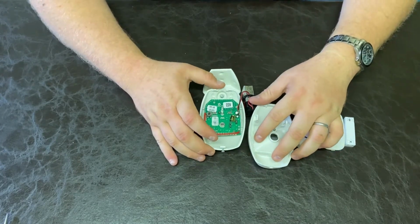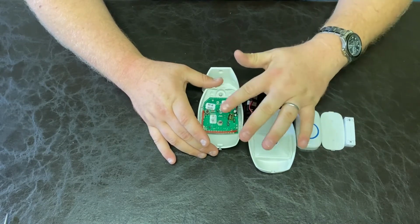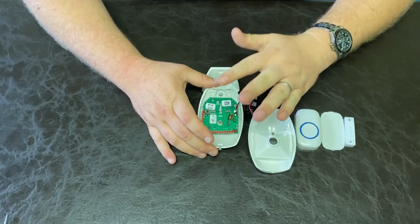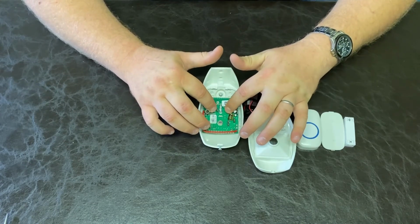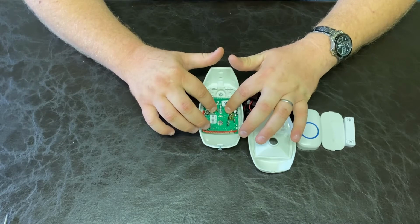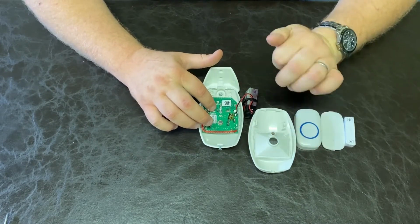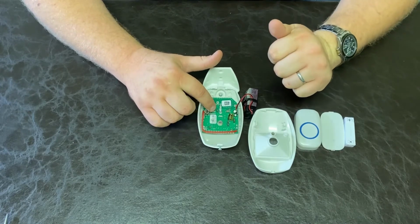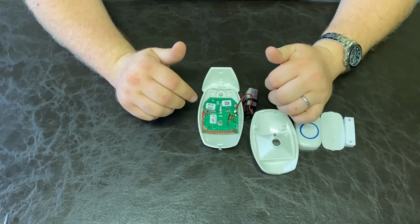Now let's move on to the zone. Let's say we are going to put this on one of MAMI's super tracer alarm panels, and we want it to be zone 1. We'll hold in both buttons until the red LED flashes again, and we'll press the increment button twice now to go into channel programming. So 1, 2, then step. Now we're in channel programming.